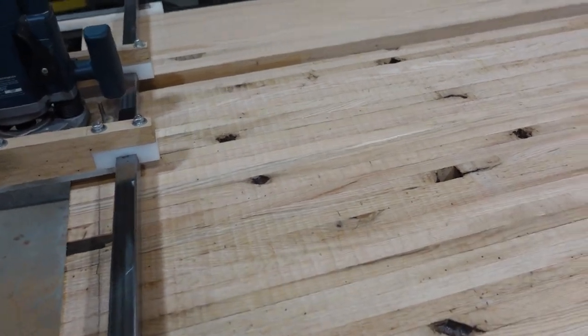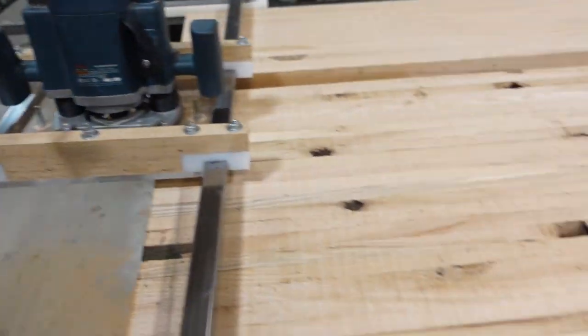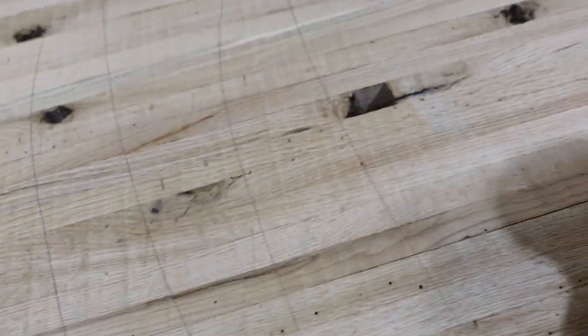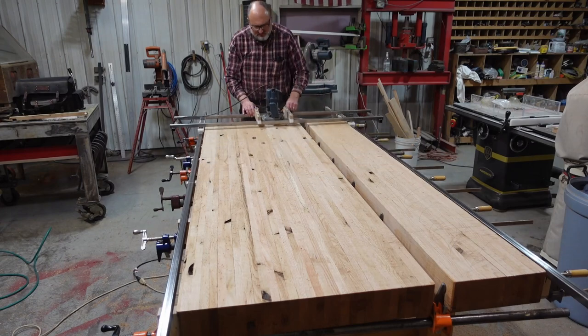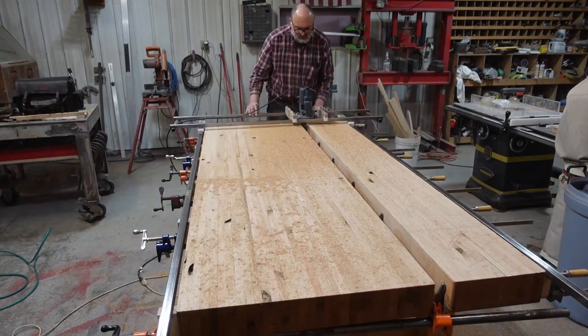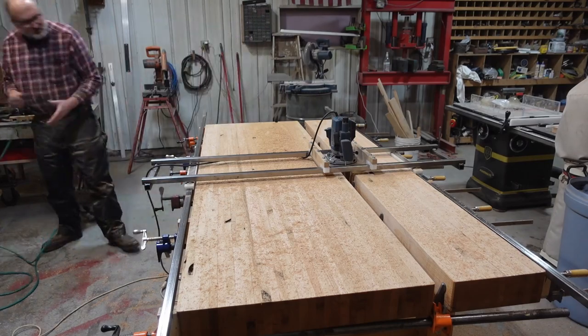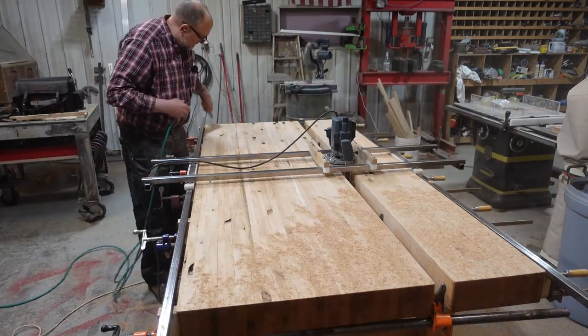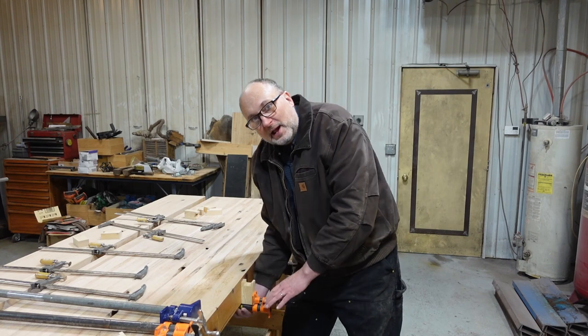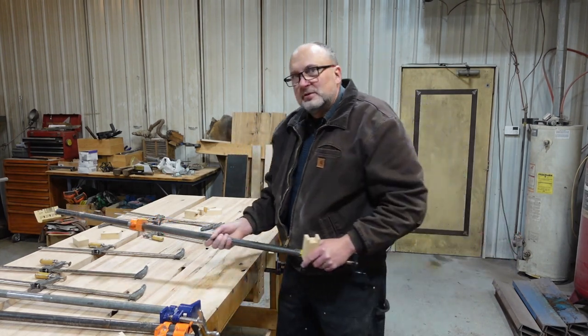Like with anything, if you get the jig set up right, the actual process here is very simple and quick. I'm not using anything fancy — I've got like a three-quarter inch bit on here and I just wail through this in a hurry. This is nothing to be intimidated over, that's for sure. I'm going to take off a little bit more; I just adjusted my router down ever so slightly. There were just maybe a couple spots that needed a little bit of contact with the bit. So right now I'm just taking off my clamps and getting ready to do some epoxy work.